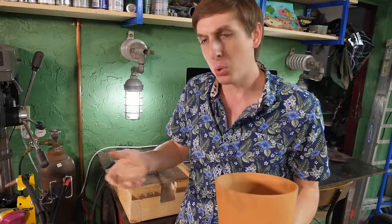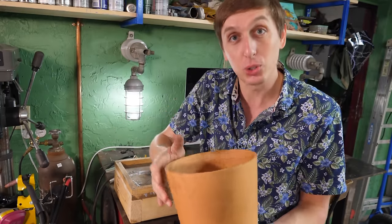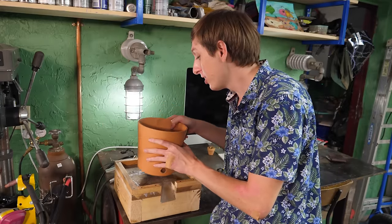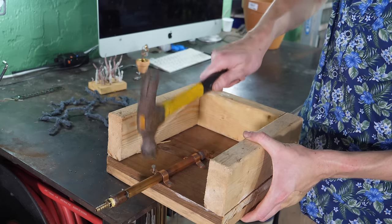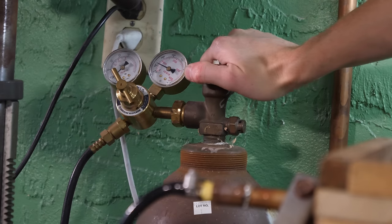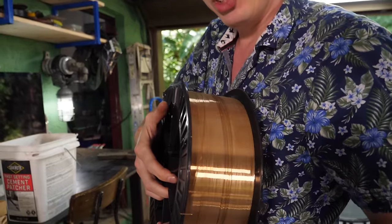I've got an idea and I think I can fix both of those problems. My first idea was instead of pouring all the metal BBs into a shallow pan, we're going to use a tall flower pot so we can get cooler, more natural looking shapes. I built a platform we can set this on, and under the flower pot I have a little tube connected to argon gas. The other problem is these things are fragile — the steel BBs aren't really getting hot enough to melt together, they're kind of just fusing. Fortunately I have this: 33 pounds of silicon bronze wire to act like glue holding the steel together.